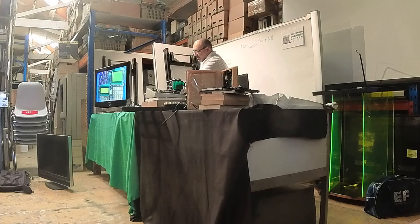So it's actually loading. You can see that the bottom LCD segment here is flashing, and that's saying there's something happening. We're getting data loading into the TEC by Intel hex format. This is how I program. I write it in the assembler on my computer, load it up like this. This is a pretty big program, and it says pass, so that worked. So I've got some graphical LCD programs that I've written. Let's do 4000. We'll press go.